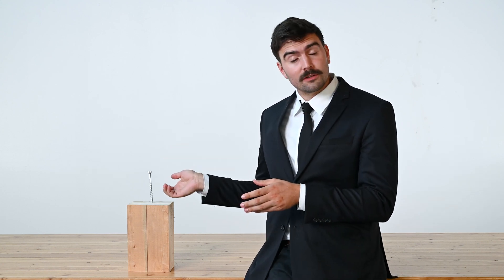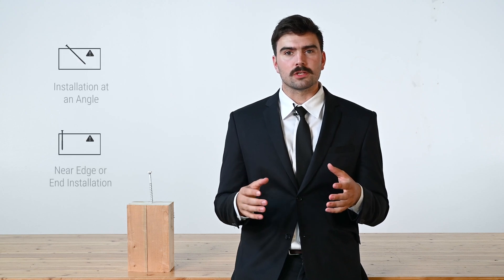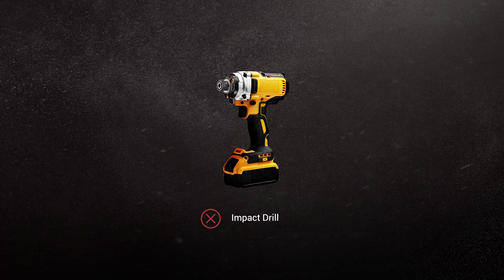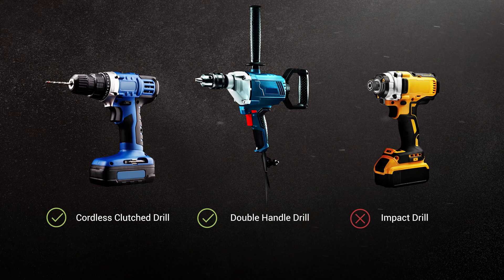As well as being a partially-threaded fastener, meaning that it brings together two connection members. Now, regarding the installation of those fasteners, we do have some recommendations. If you are in a situation close to an edge or at an angle, even if they are self-tapping, you might want to consider using a pilot hole or pre-driller. We would not recommend using your local mechanic's impact drill, as this might damage the fastener. On the other hand, we do recommend you use a low-RPM, high-torque corded drill. If you are looking for more information on installation, please go on our website and download our design guides.